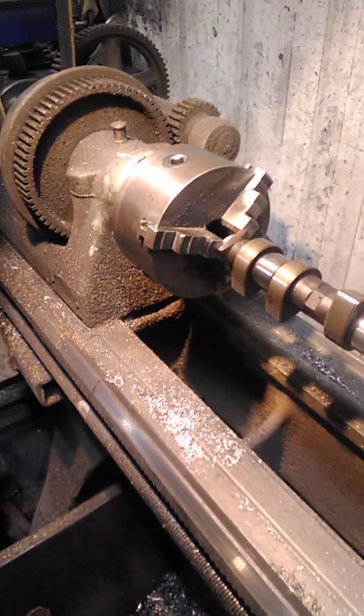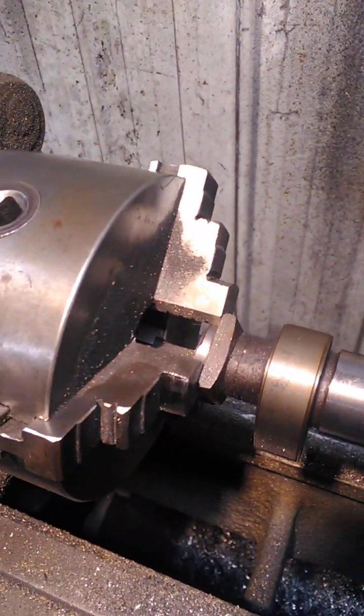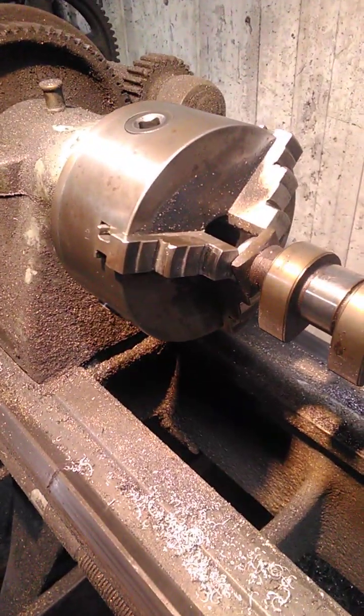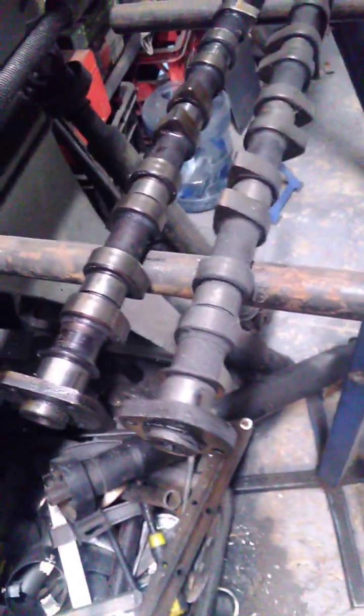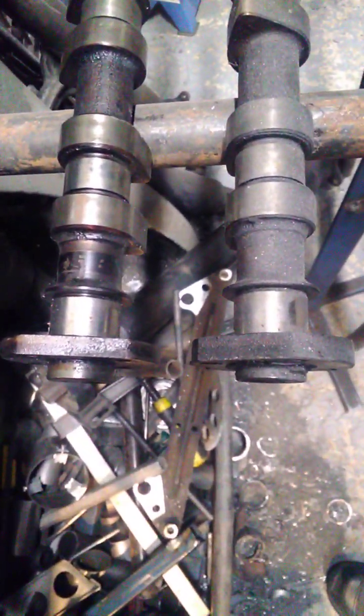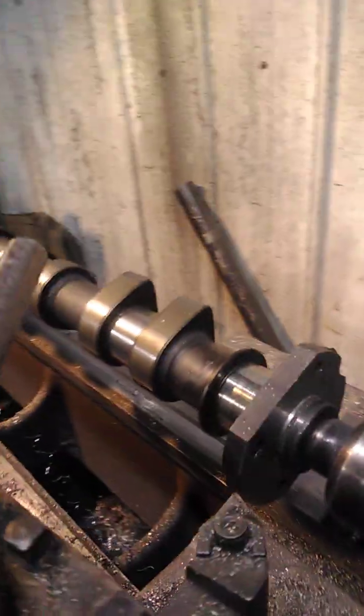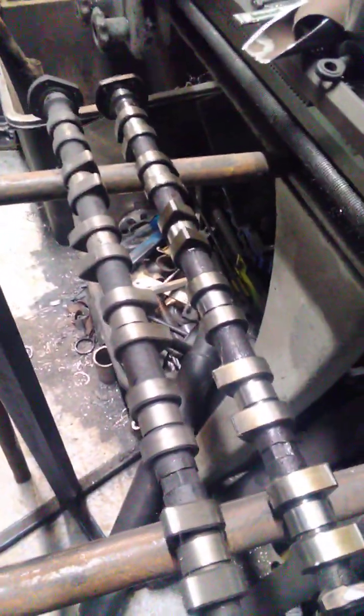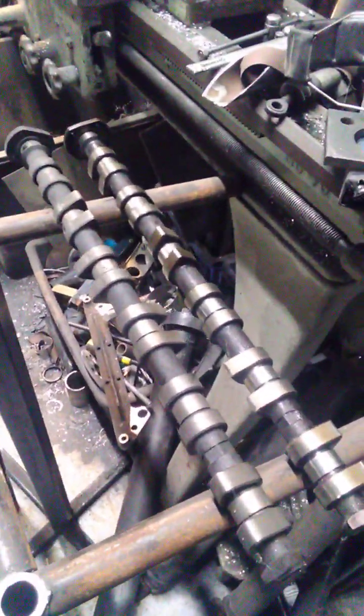This is how I had to work it out — I had to actually trim the cam. I just couldn't grab this end in the chuck and then cut that face. Exhaust on the left, intake on the right. That's how the intake looks, ready to go in the lathe. Thanks, like and subscribe, and hopefully I've taught a few people a little bit about modifying some camshafts. I will put this up and tag it so people can see. Thanks.